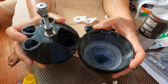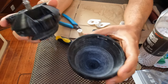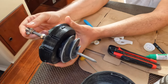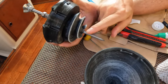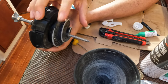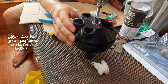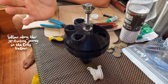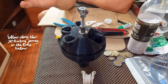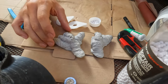So this is the first iteration of the mixer. This is where concrete goes. And this part here, when it moves around, is gonna be mixing concrete. And the auger at the end is gonna extrude concrete. So this is the volumetric extrusion part. And this is just mixing the concrete so it stays fresh and doesn't clog. Concrete printing project, I think it's less geared towards sailors, but more geared towards people who live in a house, or people who want to build a shed, or make their first furniture out of concrete. I hope to be able to print boats in the future, floating houses.